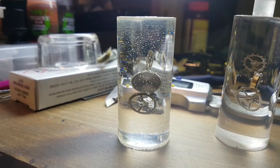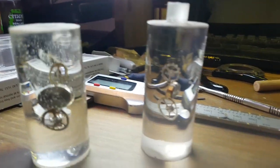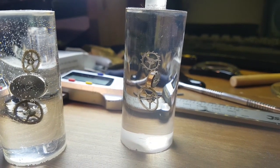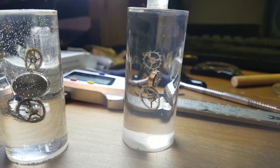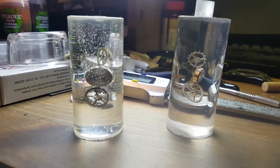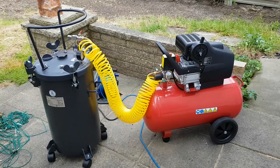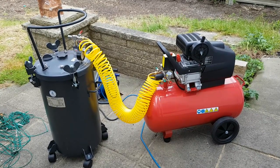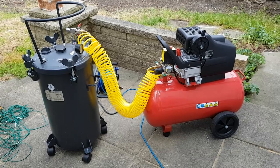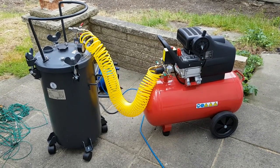Similarly, looking at this clear resin — on the left hand side you can see a piece that wasn't pressure cast, and on the right hand side one that was. You can see there are plenty of air bubbles in the one on the left whereas there aren't on the right. That's quite a clear demonstration of the benefits of pressure casting. So I hope this was useful if you are thinking about trying pressure casting — I can recommend it as a very useful method, particularly if you are trying to produce highly detailed work or just want to achieve a higher standard for your casting than you can otherwise achieve. Thanks very much for watching and I'll see you next time.